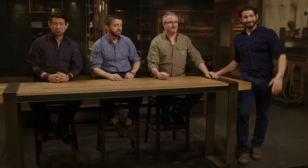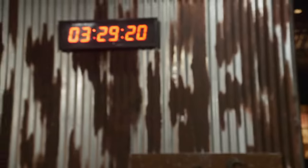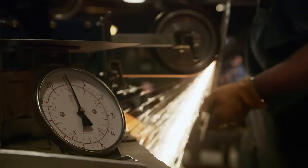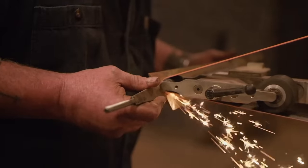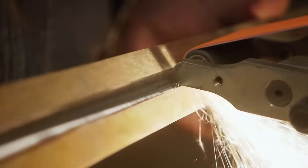Steven is in the quench — flaming sword! I have a fiery sword of glory, and I'm trying to get this sucker over to my jig to keep it from picking up too big of a warp. I just hope I got it in there quickly enough to help keep the blade straight. I get my sword out of the tempering oven — looks good. I can't just make a blade that looks good and feels good; it's got to fall under that three-pound limit, and I'm fighting for ounces. Is Dave making that fuller wider? That'll take some more weight off — adding maybe an eighth of an inch at the base of the fuller tapering along the blade.